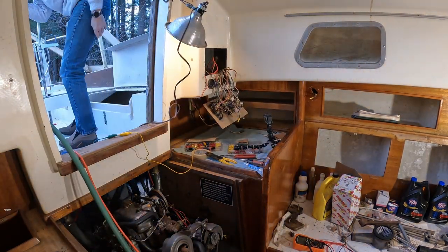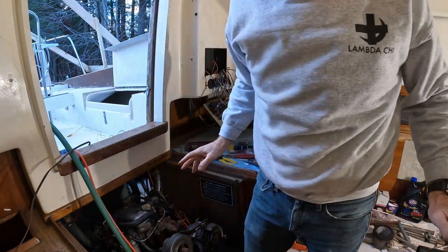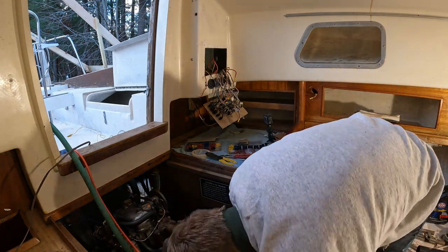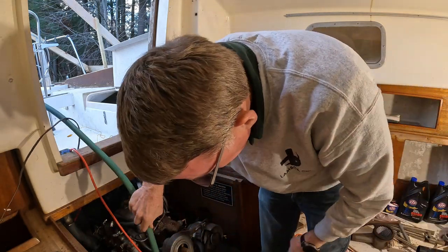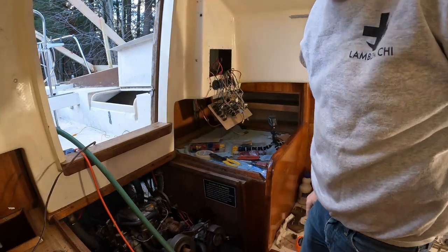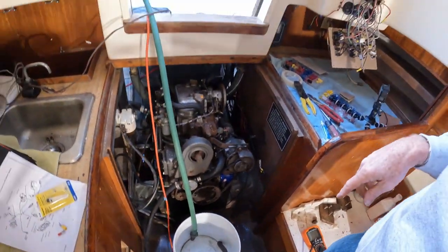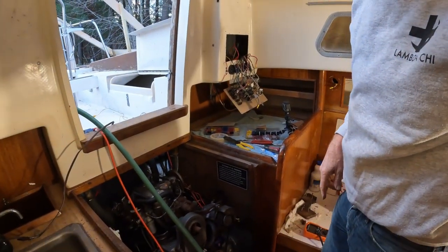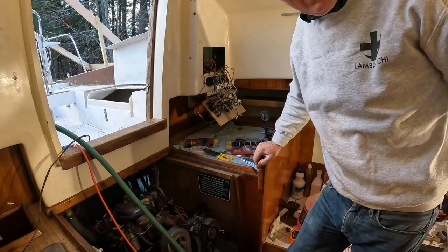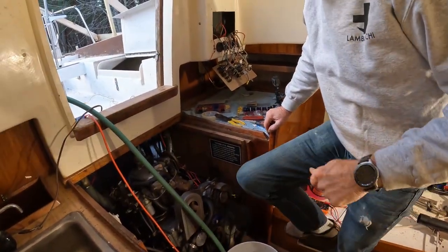Ow! Son of a gun, I just hit my head on the frame. Well, that was freaking awesome — we got the new starter motor to turn over! I am now going to go turn the water on and see if we can get this bad boy running. We'll fill the bucket up with water, the intake will pull the water out, run the engine a little bit, get it warm, then I'll shut the water off, pour the antifreeze in, suck the antifreeze up, and run that through the engine.